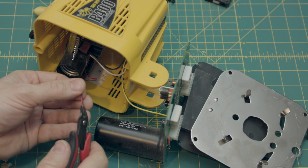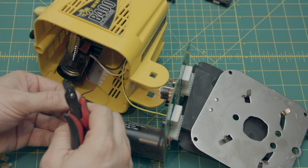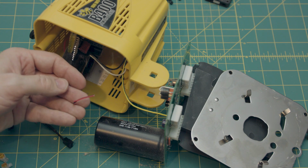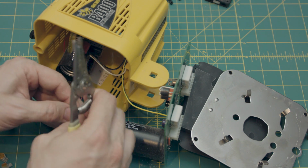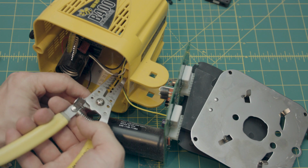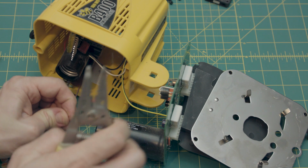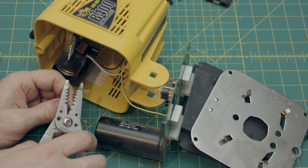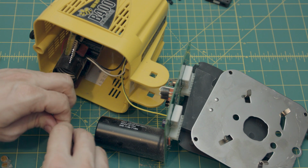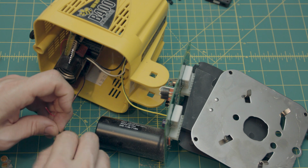Okay, so you want to split out the wires because they're stuck together, and then you want to strip the wires. And these wires are too small to go in any of the predetermined hole stripper things, so you got to kind of deftly strip them out with the cutter portion of the pliers, but that's not too tricky. The shielding on these cables breaks and slides pretty easily.